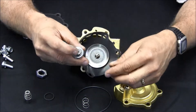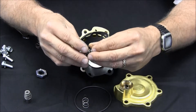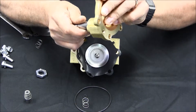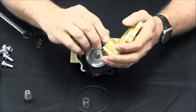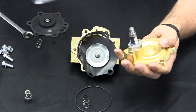Screw the spring on and place that new plunger in the stem. Next, place the washer on and screw it back into the top of the valve. Again, use the included special tool to tighten the stem the rest of the way. This is an O-ring seal, so it doesn't need to be over-tightened.